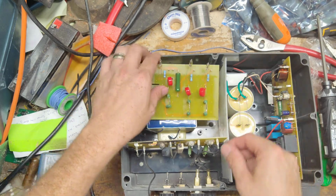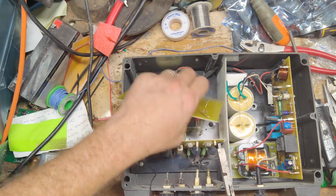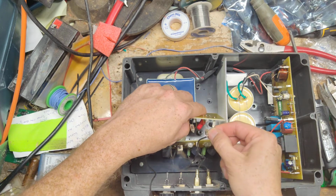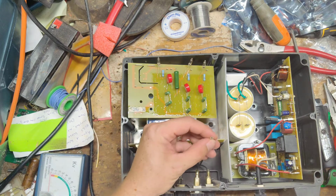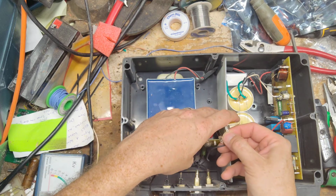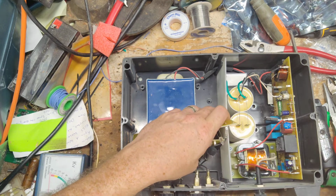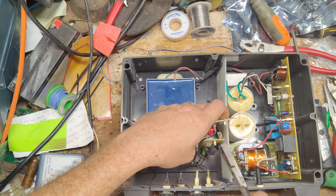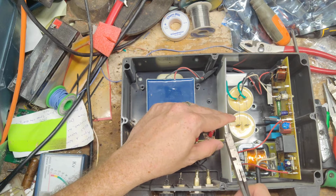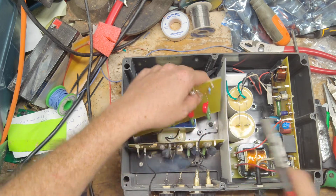So what we're going to do first is I'm going to unplug one wire at a time, and we're going to plug it on the new one. These are little bitty spade connectors; the normal ones are like 1/4 inch, these are like 1/16 inch, I don't know, they're real small. Because the charger itself puts out good power at the transformer, but there's nothing coming out of it because this output board, which is your lightning protection board, puts power to the different terminals on the fence and to the knobs.